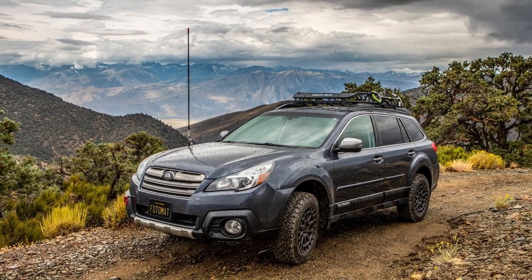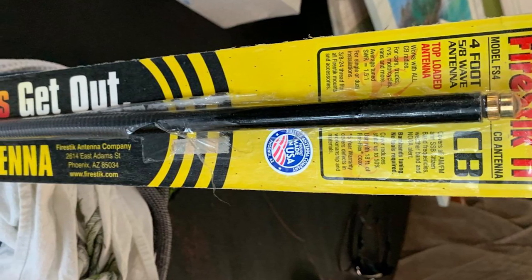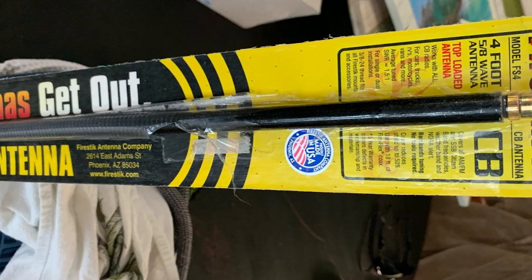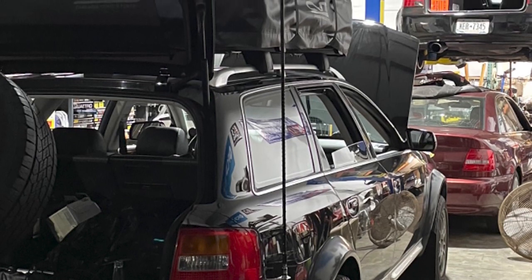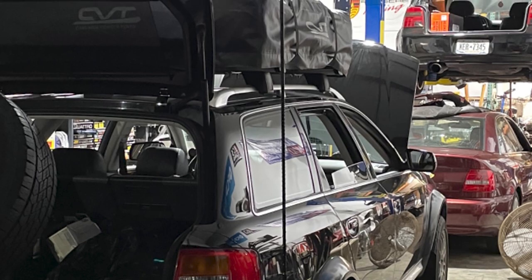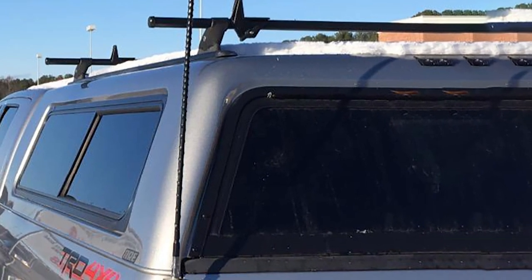This unit is rated at 900 watts and features a 5/8 wavelength design. Fire Stick's unique hand-tunable design makes calibration a breeze via the threaded tip. This ground plane antenna provides excellent performance, yet it lacks a base or coax cable. The Fire Stick 4-foot Tunable Tip CB Antenna uses a tapered 3/8x24 threaded base for easy mounting on standardized bases.